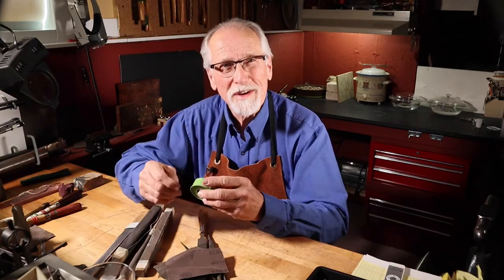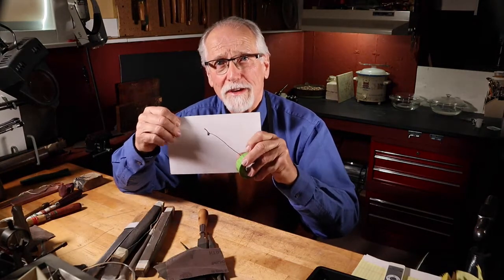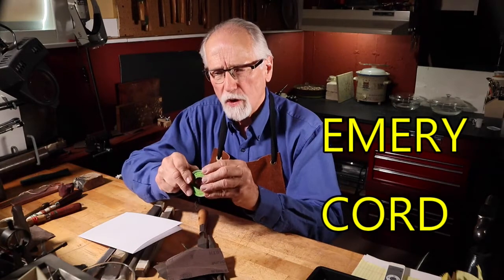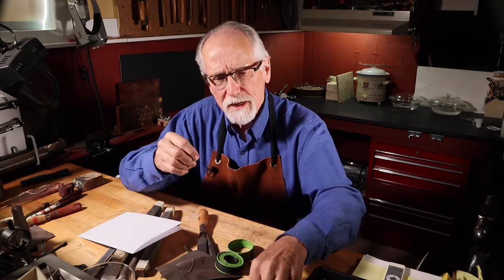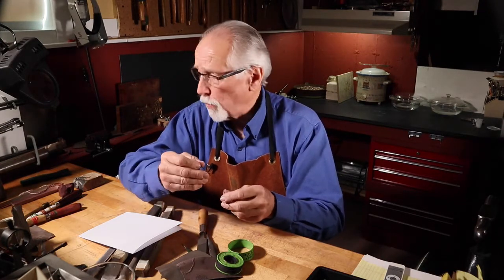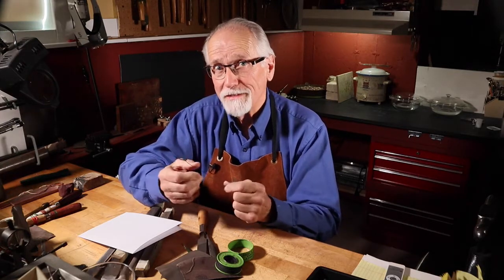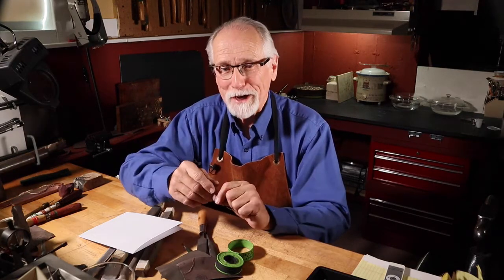Here's a really neat thing I've discovered over the years — this is an emery tape or emery cord. It comes on a spool and has emery grit embedded onto the cord. You can slip it into small areas on a piece of metal, attach the other end to a bench vise or a nail, pull it tight, and work your metal back and forth on the cord. It's very abrasive and will leave lots of marks, so make sure you can get back in there and polish and buff those out.